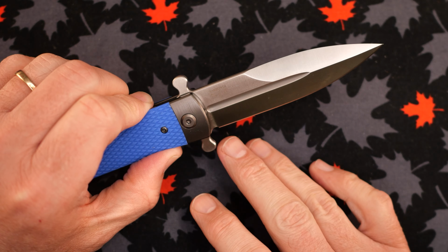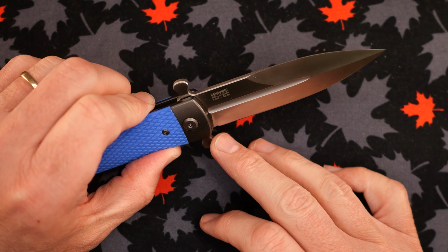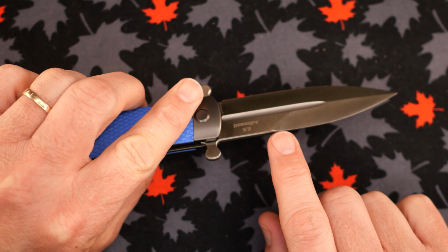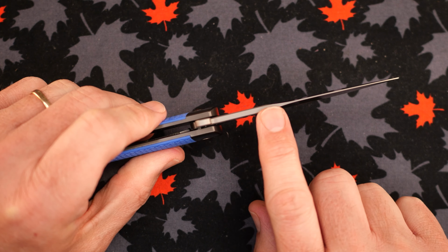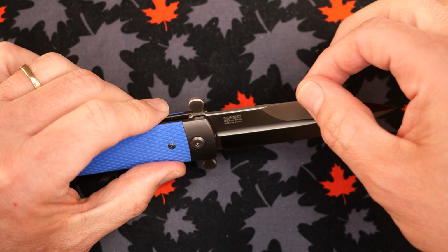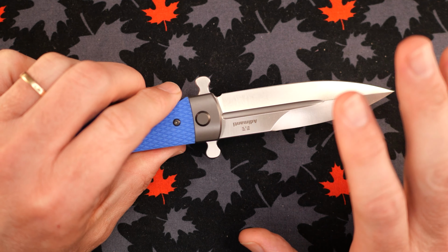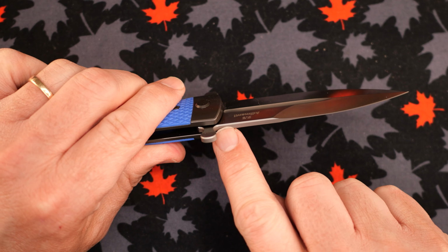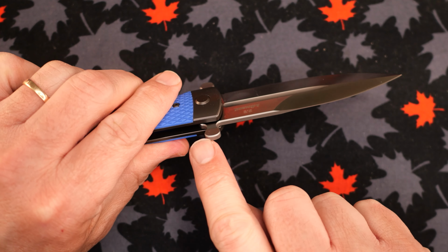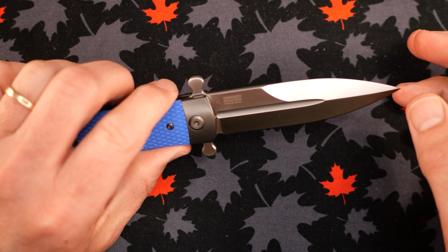They kept it fairly small, and yet it's big enough to be effective and good enough for sharpening the knife a number of times. And the spine of the knife, you've got a chamfer on the spine here until it comes down to this swedge, this false edge, if you will. And it was bead blasted before they ground it. So you've got bead blasting here all the way around on that edge, bead blast in the fuller, and that's about it. Other than that, it's a satin finish.